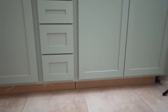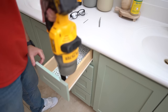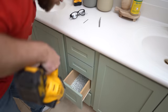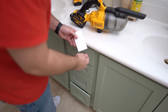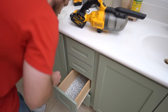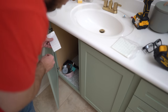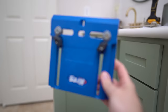As for the toe kick, I'll install that — you'll see it in the final video. This little mini DeWalt shop vac is great for project cleanup. Here I'm installing clear rubber bumpers for the doors and drawers. For drawers you only need the top corners; for doors I do it on the top and bottom. This stops the paint from sticking to itself and keeps the doors parallel with the hinges.